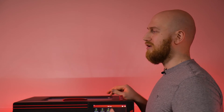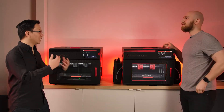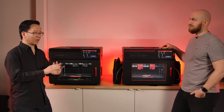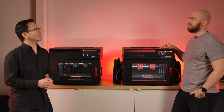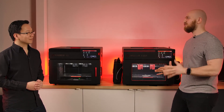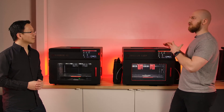If you just get the E2CF, you're somewhat limited to the carbon fiber nylon family. You can adjust the firmware and get similar capability to the E2, but that takes away from what this machine is about. The intention of the design is different — if you're looking for a closed experience where everything is already set and you don't have to play with settings to get really good parts, go with the E2CF. But you may also want a printer for PLA for design verification before spending money on the more expensive filament for end-use parts.